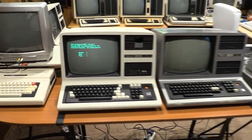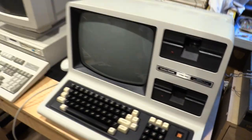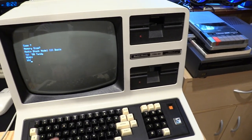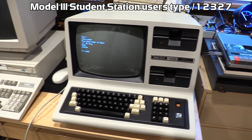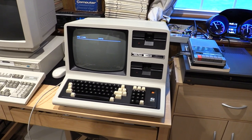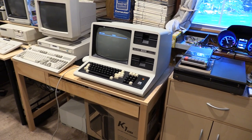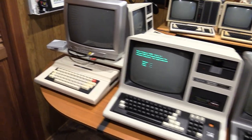The Network 3 is running — only the host and the controller. And over here is our recently upgraded Model 4. Let's see if we can get this thing to play nice and bootstrap. You'll notice there's only one cable running to the Model 4 now — there's no cassette connected. So I'm just going to hit Enter here. The way this works is I should be able to run the system command and then go slash 1, 2, 3, 6, 3 — and that should eventually result in a baud rate prompt. And it did. Look at this — D, I, R. Look at that! We have a self-booting Model 4 student station, just like Radio Shack would have sold. This is one less machine I have to run a cassette cable for, and I can now boot Network 3 all the ways that Radio Shack intended. I can do Model 4 student station, I can do Network 2 cassette, and for the bougie types, I can do the floppy disk boot on the Model 4 that's back there now.